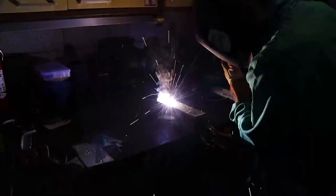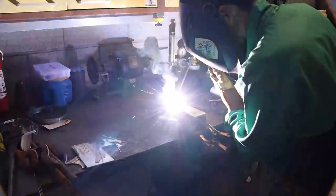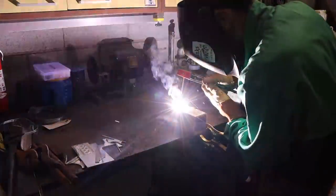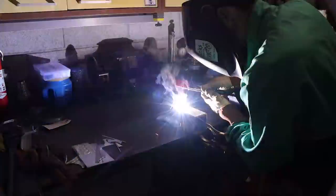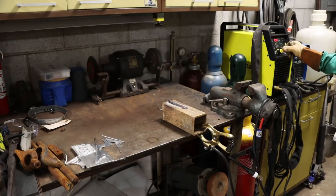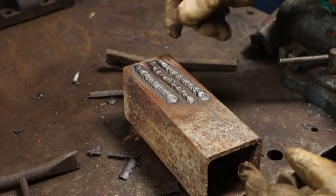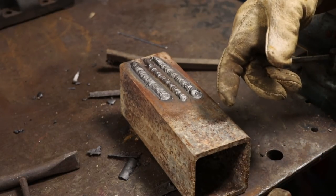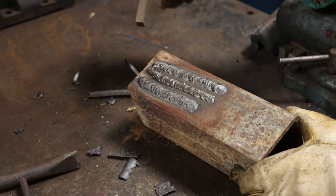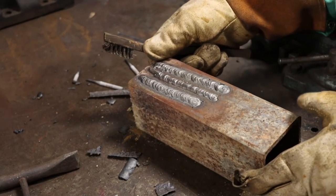Just like the vast majority of machines on the market, this is capable of stick welding as well. Burning some 3/32-inch 7018s here, anywhere between 80 and 100 amps, just seeing how this machine performs and how stable the arc is. No complaints — it seems to do pretty well. That actually started really well considering this is a crusty, rusty piece of steel. That was 80, 90, and 100 amps with a 3/32-inch 7018 — nothing wrong with that. Stick welds just fine.